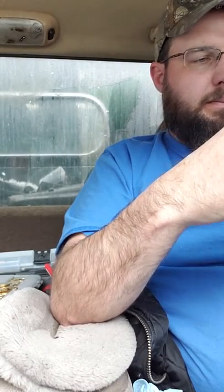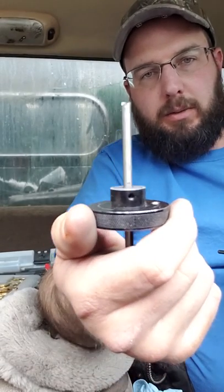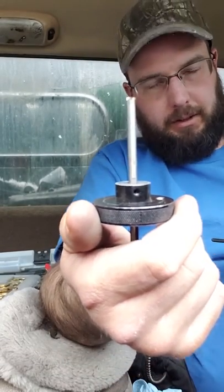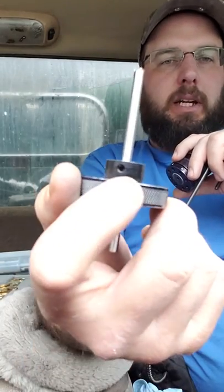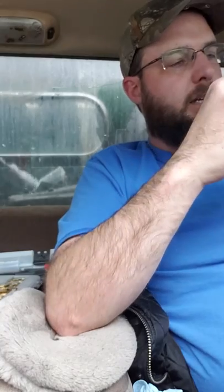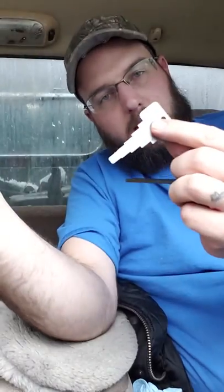But anyways, if you need to adjust this, I suggest you make sure that everything's calibrated first. If you need to calibrate it, you can adjust it right here if it's cutting off. You can tell if it's cutting off because you can cut your key, and then use your decoder to measure the cut to make sure that the key is working properly.